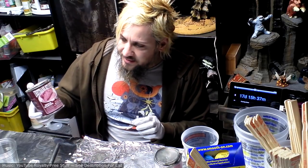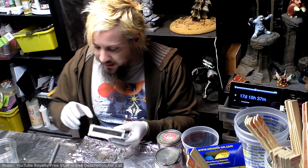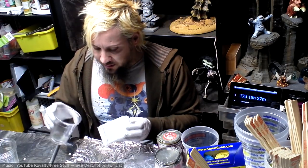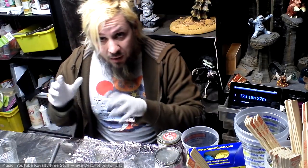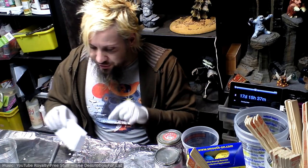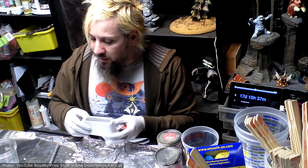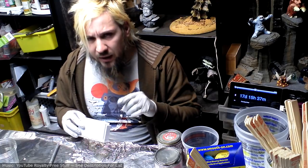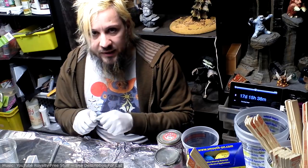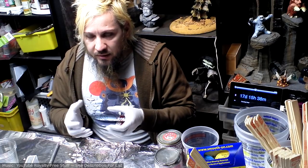One of the things that I have is this Tap Plastics urethane RTV system. I do not recommend this stuff. Every time I've used it, I've been disappointed, but it's what I have on hand, so I'm gonna try it on a few little pieces that it's not a big deal if it has the problems that I've encountered in the past. The problems are it sticks to the sculpture. Even when I put a very liberal coating of Vaseline on there that should keep anything from sticking to it, it's had problems where it just binds on and then tears when you pull it apart. The other problem is the mold you have when you're done is crumbly. It's just a terrible product.